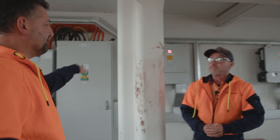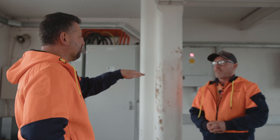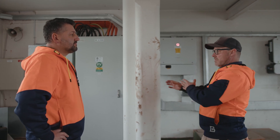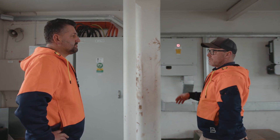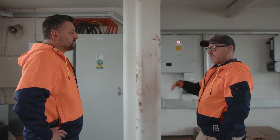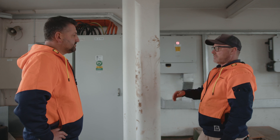When doing those breakers, is there an order of which way you do them, or does it matter if you go right to left or left to right? In that situation, the three on the right — what we have in that PVDB — it doesn't matter which order I take those in. What we're trying to do is decrease the load on any switching that we're doing, so we're trying to bring it down in stages incrementally.